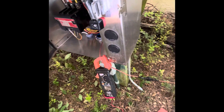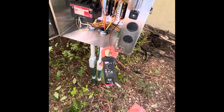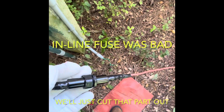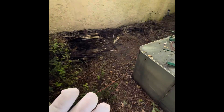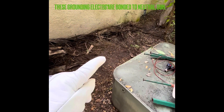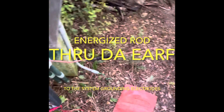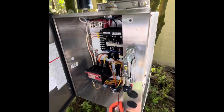I talked all that shit yesterday so now I gotta do it. It's on a 20 amp fuse here, but this inline fuse is only 10. So if we draw more than 10 amps going through the earth — because that's the only way it's gonna get back here — this is hot, it goes to the ground rod, and the only way it can get back is through the earth. There's a ground rod right there, and there's one that's six feet away. So I put a shorting cap in, gonna turn this on and it's gonna stay on.